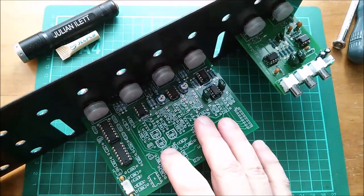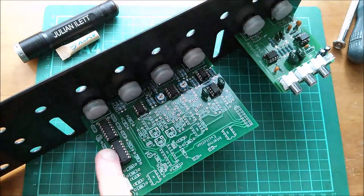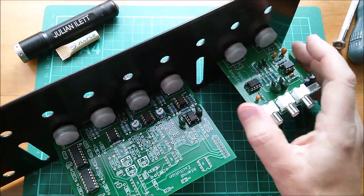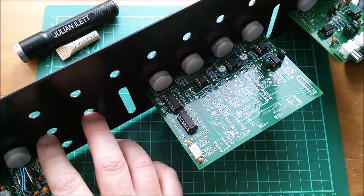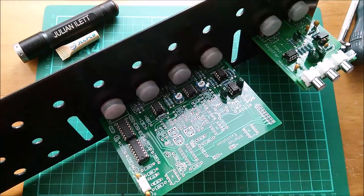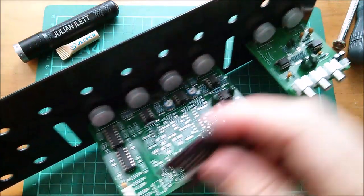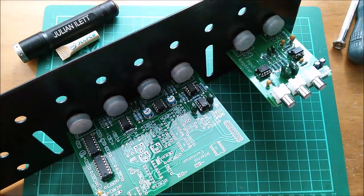This is the excitation board which is just a noise source really. It's got oscillators and a noise generator that can make shhhh type sounds. This is the microphone pre-amplifier for the speech board. There's an identical one which sits here in these four holes, and then there's an LED PPM bar graph board — one for the music input and one for the speech input.